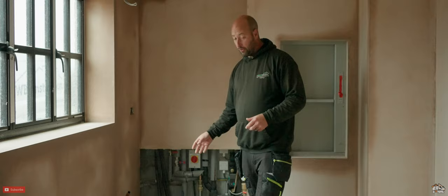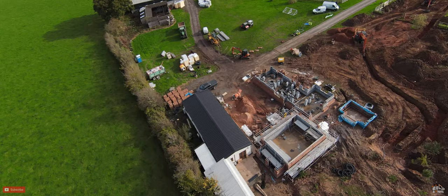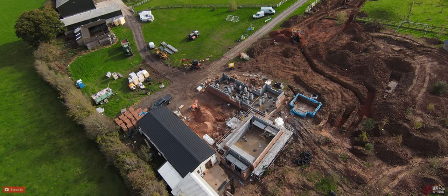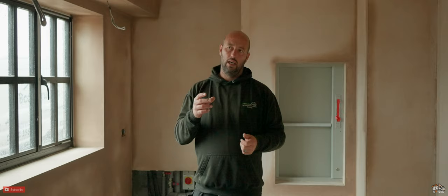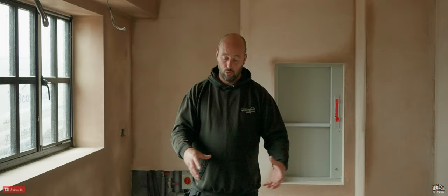But the heating is on. So I've had a massive panic for a good while now. We have installed all of the ground loops for the ground source heating. They were the 1200 wide by 1200 deep trenches where you have a pipe running down one way and coming back the other. There were six of them, I think they were 100 meters long from memory. Then we backfill, that goes to the manifold that's outside, and the manifold then takes all of that through one or two big pipes through to the plant room where we've got all the other gubbins.